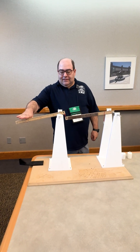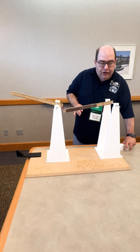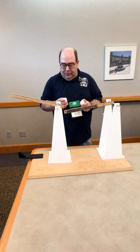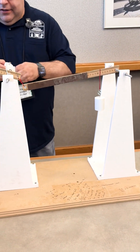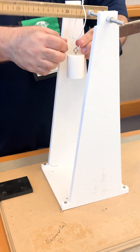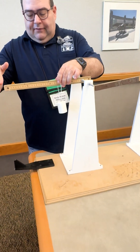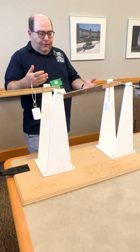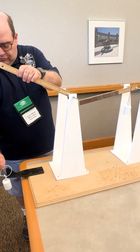We have a first class lever attached to another class lever here and it is going to be used to find the ratio of unknown masses. I have one mass that I would attach say there and another mass that I would attach right here. We'll attach this here — you could use S-hooks, anything like this — and then we can adjust this and move this until I want to get this level. Once it's level, I can take these measurements from the fulcrum, and this can just go right back onto here.